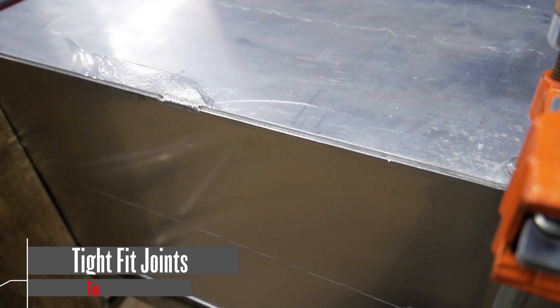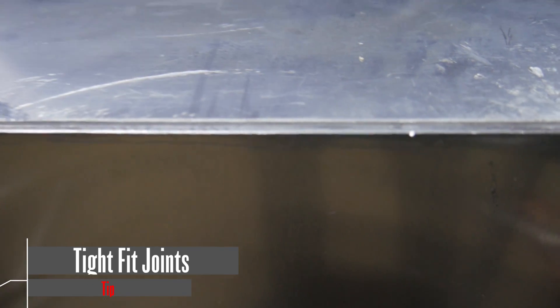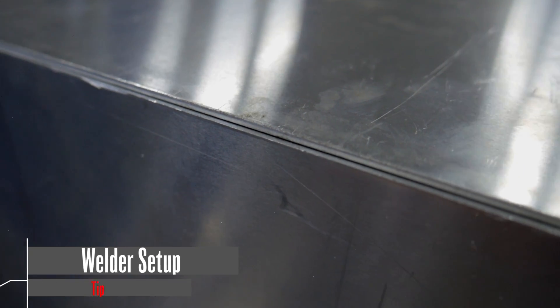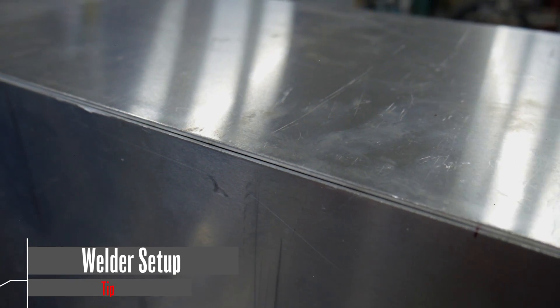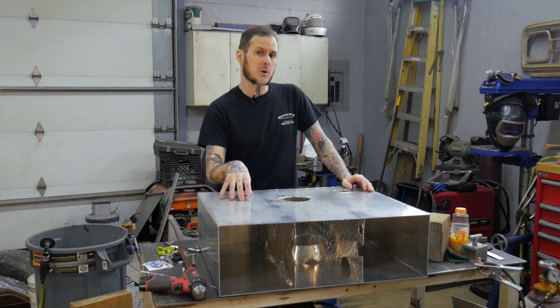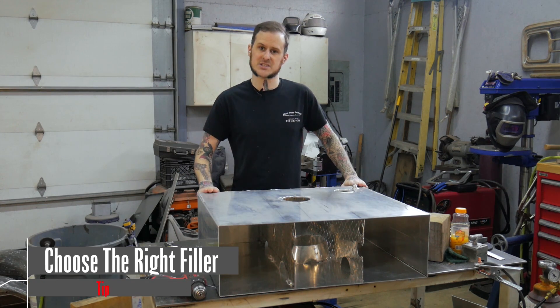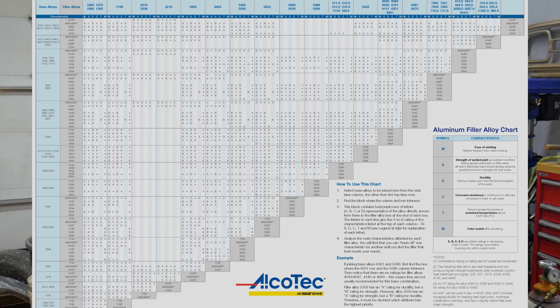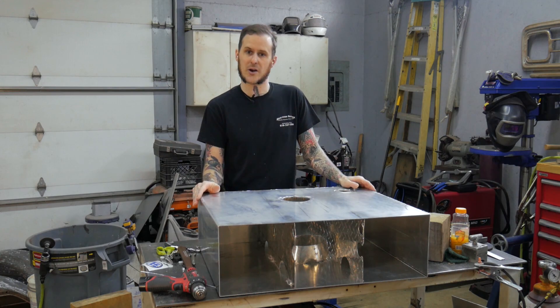Along with cleanliness is fit-up. Aluminum does not fill easily — if you have a gap, you're going to be fighting yourself, especially if you're not an exceptionally good TIG welder. Aluminum welds do not penetrate particularly well, so you need a good V-joint. Make sure your welder is set up properly for whatever material thickness you're running, and use the right filler material. I'm welding 3003, and 4043 is the proper rod for this situation. I'll put a link in the description to an Alcoa welding chart — a cross-reference chart where you pick out what materials you're welding and it gives you the right filler rod choice. I use that all the time and it's an extremely handy tool.